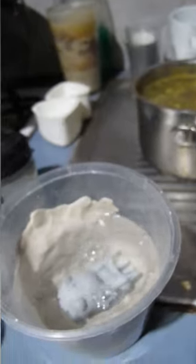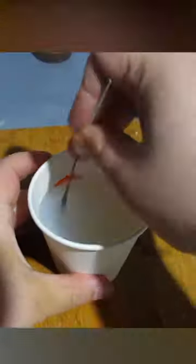A mold box was formed with air-drying clay and capacity tested with water. The model is lubricated with oil, then using proper two-part casting silicone — the cheapest available found on eBay — equal parts measured.